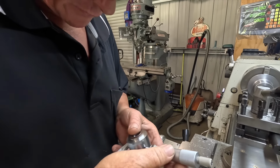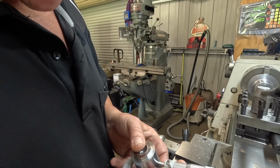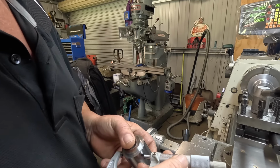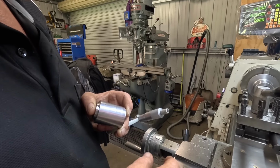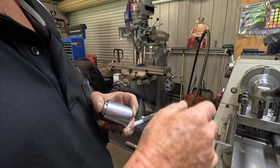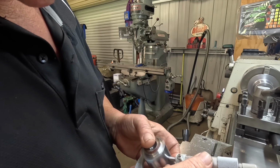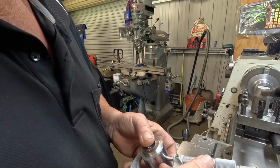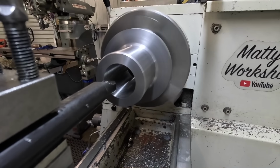Okay, so I'm just measuring this bit of 40mm shaft. It's measuring 39.98. I think I'll leave it at that, and if I have to, I'll just run a little bloody emery wheel down the... I can just open it up a fraction with that. If I got 4140 bar coming, 40mm, so if it's spot on 40mm, it should still be right. I'll leave it at that.